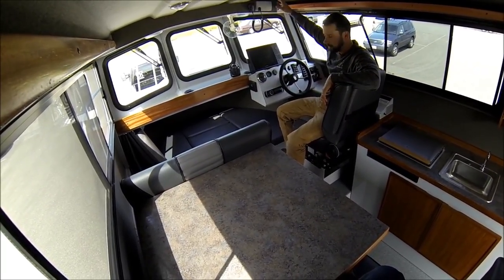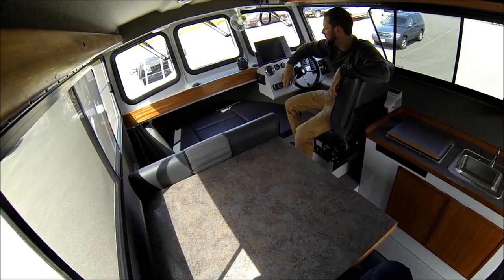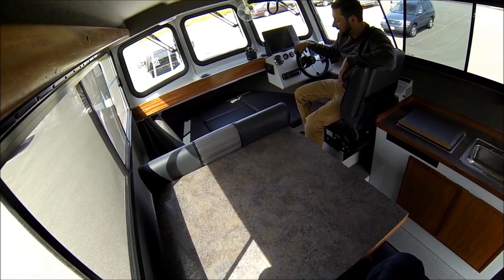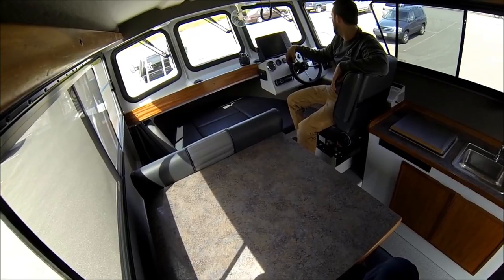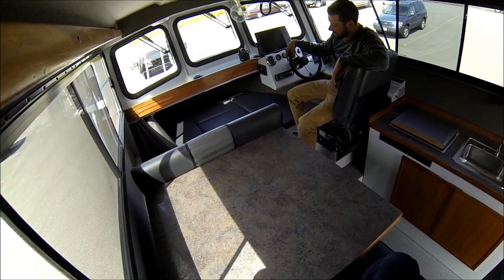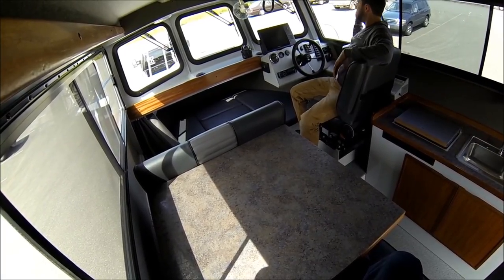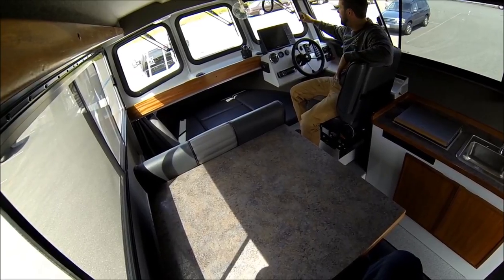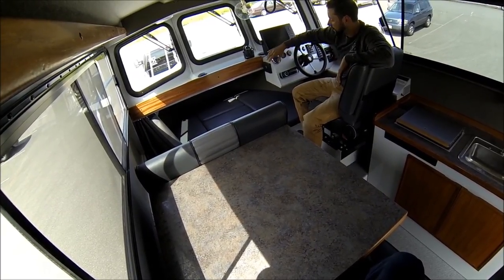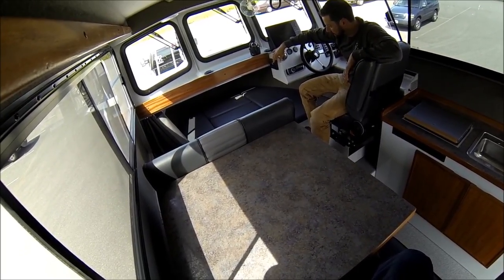He's got a 12-volt plug for charging, a Garmin VHF 200 up top, speakers, an oscillating fan, and a Ritchie backlit compass. You can just barely see the Webasto ducts for the top — which also has a duct down below so when sleeping in the cutty, there's warm dry air. There's great visibility from this cabin — big, open Diamond Sea Glaze sliding windows with screens that lock, bolt-in Diamond Sea Glaze windows in front with pantograph wipers, all standard in the pilot house. There's also a digital thermostat for the Webasto.